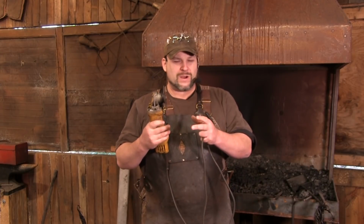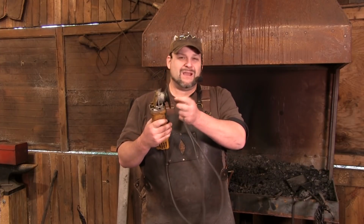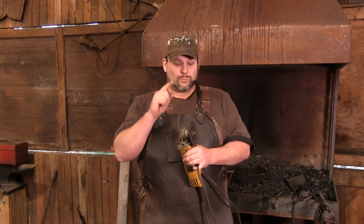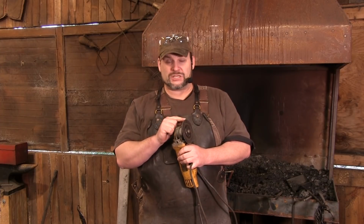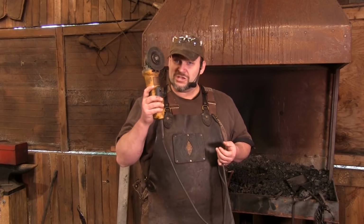These blades are very thin, and that's what allows them to cut so quickly. But if you get it off a little bit while it's inside the cut, it will crack, and these things will fly like ninja stars around the shop. Take a moment and Google zip wheel accident and look at some of the carnage that is out there. These have a nasty habit of being embedded into people's faces. So it's dangerous, but it's a useful tool.